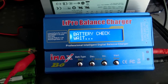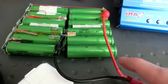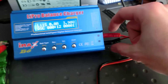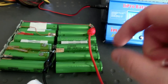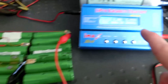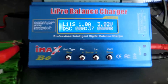We're discharging until the voltage gets down to three volts. To be honest, when the voltage gets down to three volts over this somewhat resistive wire, I think this thing's a bit out of calibration. When it's reading three volts, it's actually like 3.15 volts. Whenever it reaches that and stops, these bounce back up to like 3.6 or 3.7 volts depending on their internal resistance. I'm going to bring them down to three volts because that'll pop them back up to 3.6 whenever I stop pulling power from them.